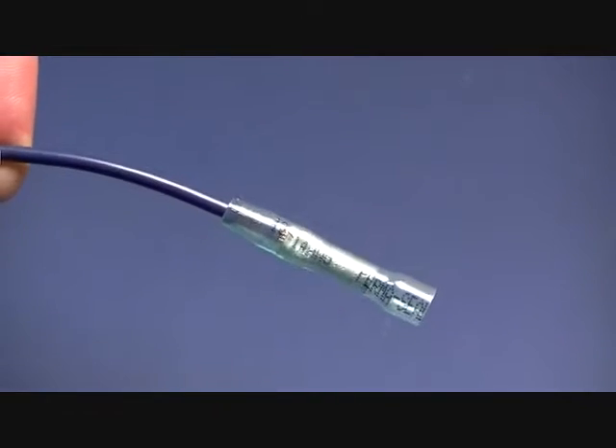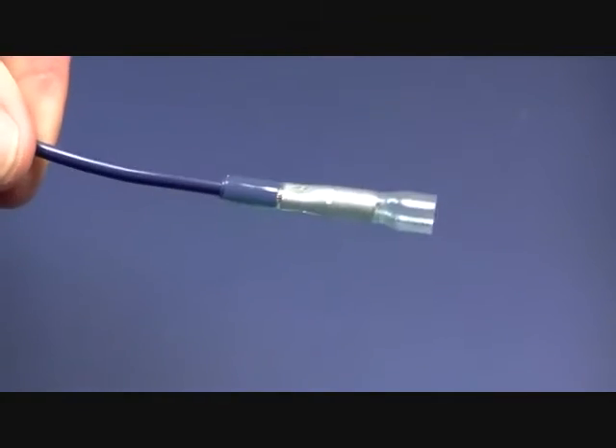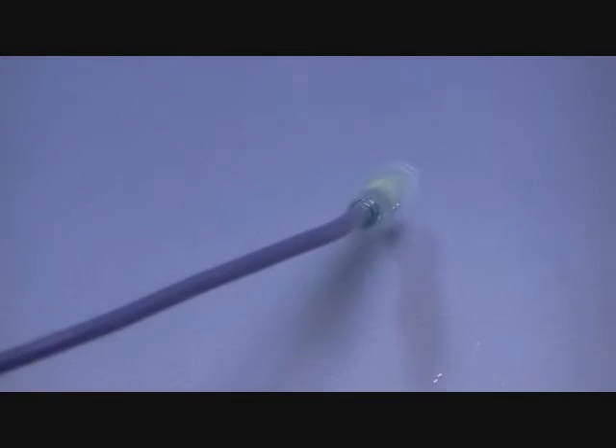You'll notice that it starts to shrink immediately. You don't have to have a commercial heat gun — this particular one here is commonly used in the painting industry for peeling paint, but it's just a commercial everyday heat gun. A hair dryer would not produce enough heat to shrink it down properly, so you want to use something that produces more BTU. You can see by looking at the connection the glue is starting to come out of the end, which means the adhesive inside has melted to a point where it forms a complete bond and seal.